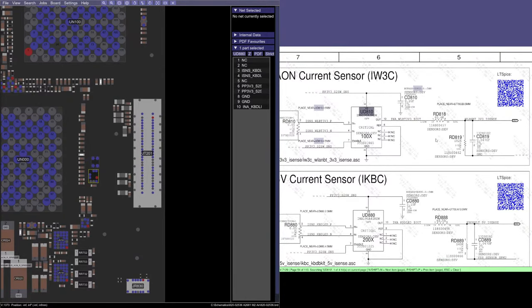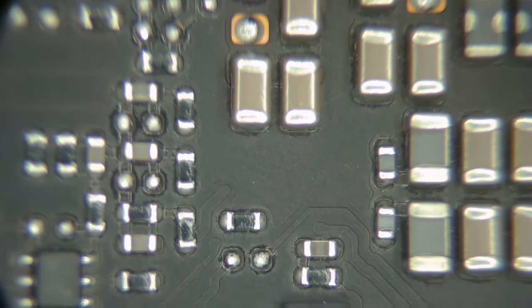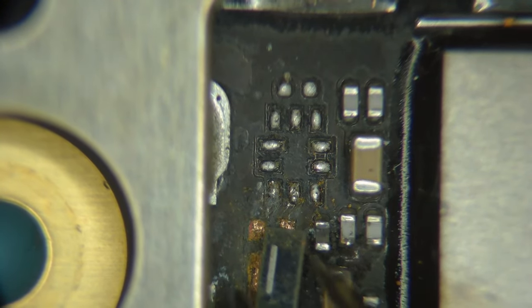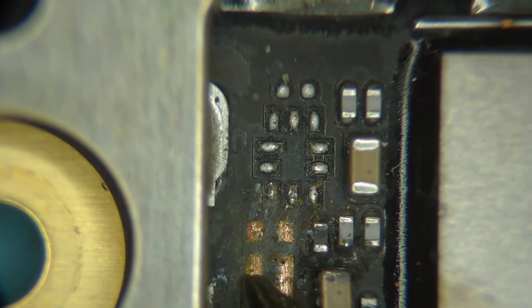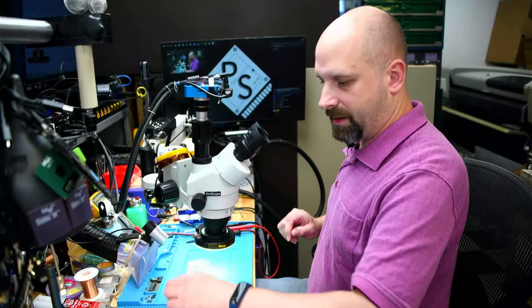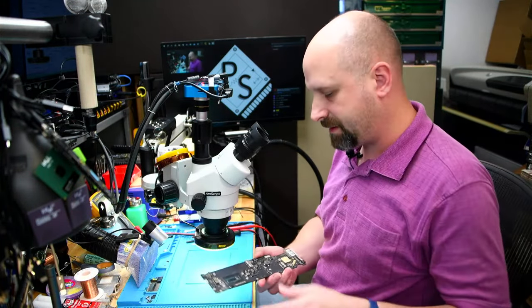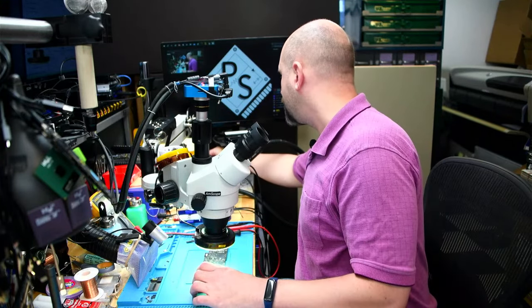So let's go back to the board, what I'm looking at right here next to the Wi-Fi. Where am I? So this is no stuff. This is not here. And so they didn't bother to change the board itself. I guess they were already in production or something, so they didn't just cap this over like they do on, let me bring in another board. So the old MacBook Air, this is the A1466, the 00165 board, my favorite board in existence. This is the hardiest board ever. This board survives just about everything except an exploded CPU.